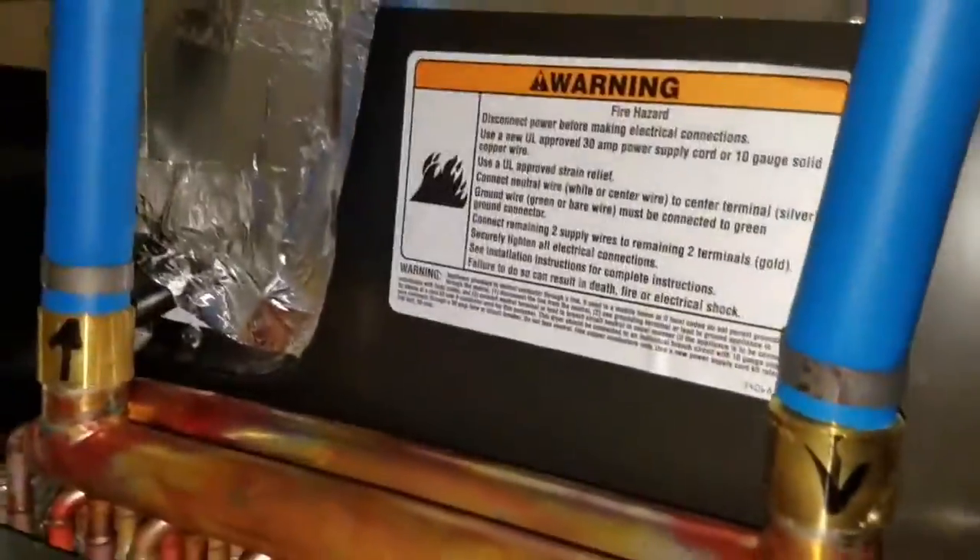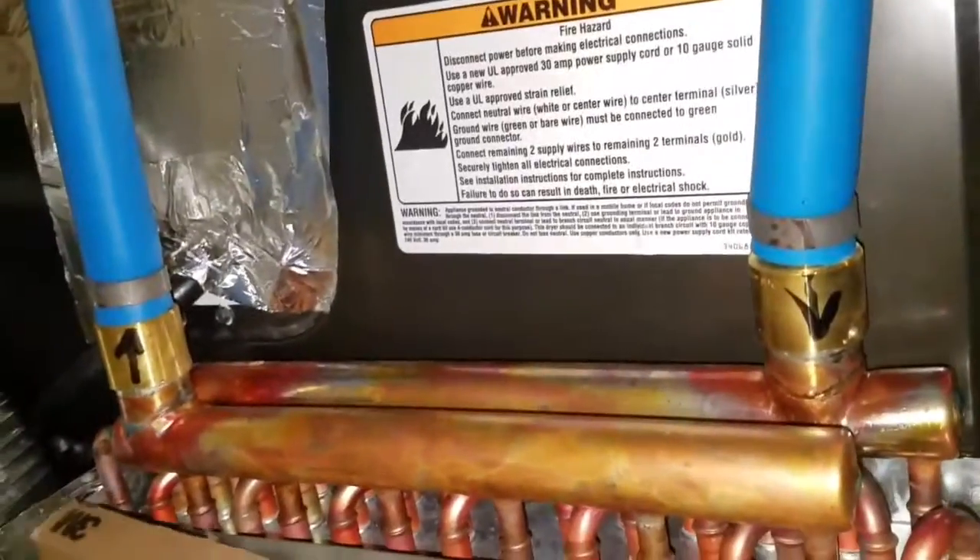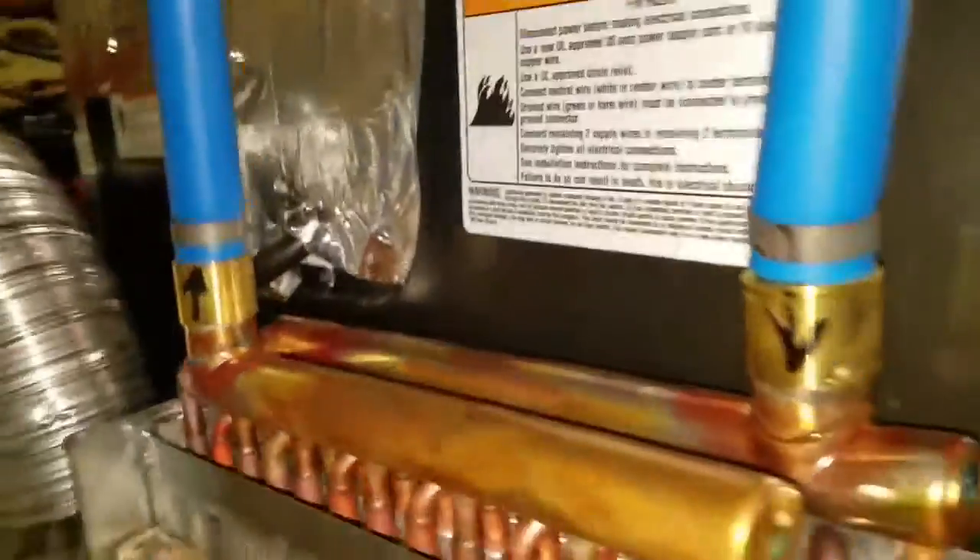It's at 106 degrees. I will insulate these lines — I just ran out for now. I sealed up all the louvers on the back, put this coil in, made this set of sheet metal to hold a filter, and sealed all the cracks around the coil. It's pulling air in through the hot water coil instead of through the electric heater, and it's doing a really good job drying clothes.